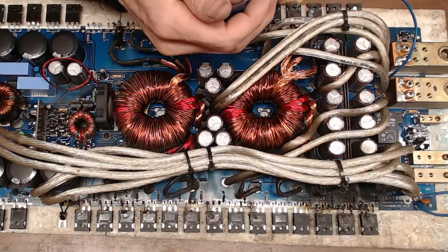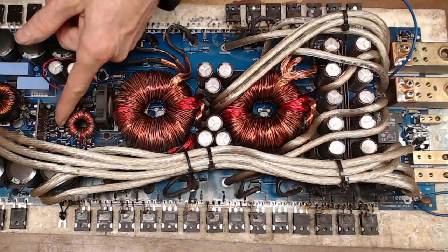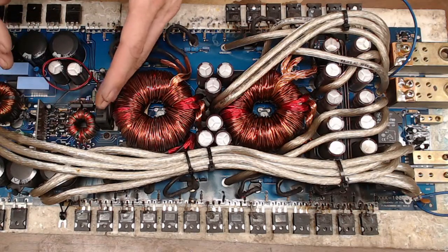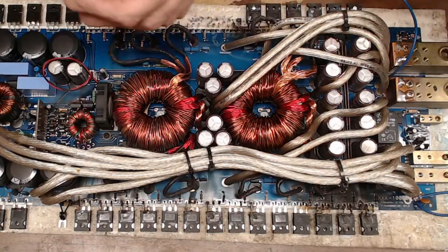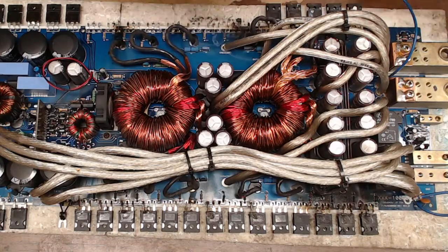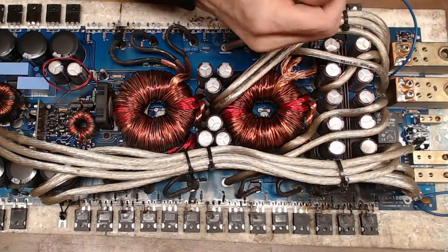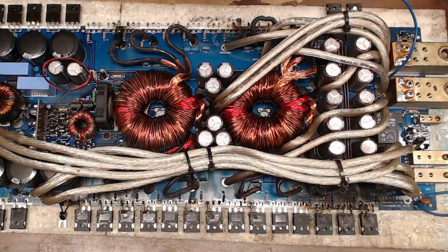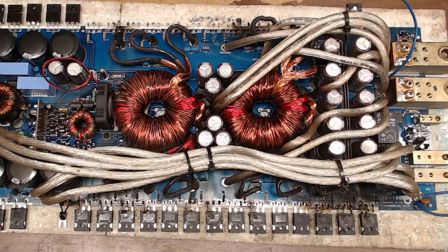And we may even get down into some epoxy repair. I don't know. You guys can see this area right here. That got toasty. I'm not showing any resistance in the PCB itself. So the PCB didn't really get burnt to a point where it got carbonized and conductive. I'm not showing any resistance in those burnt areas, but I'm still, of course, going to remove the burnt area to reduce the chance of any conductivity, odd inductance in between traces.